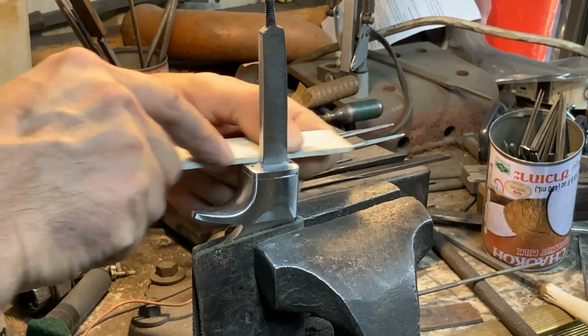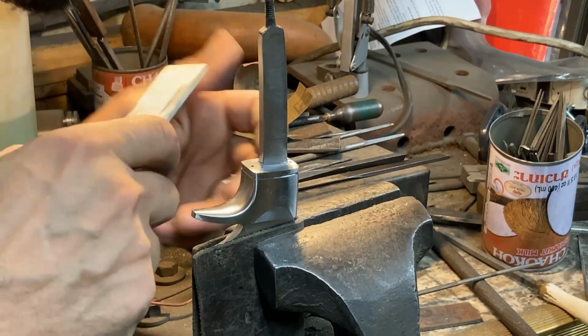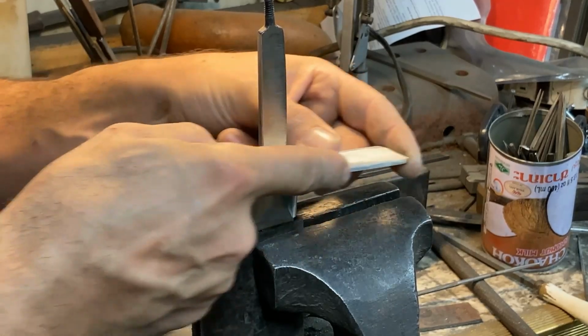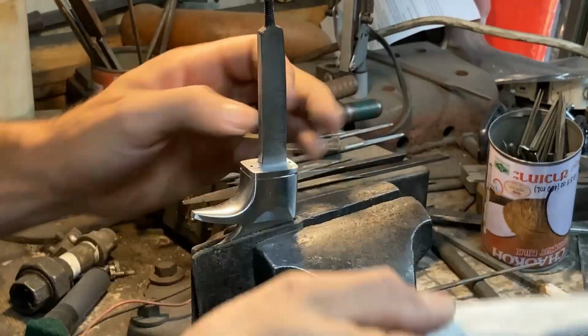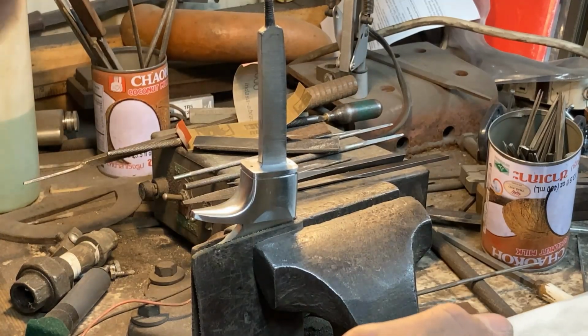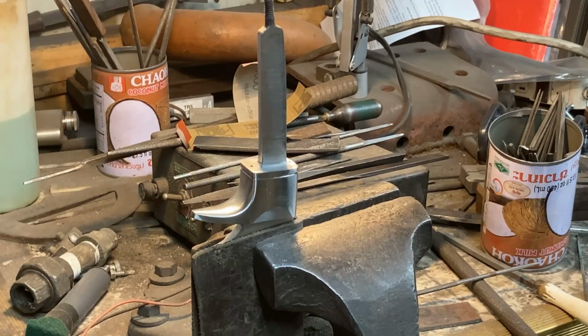Well, I did want to remove a little bit of material here that was causing some interference on the front of one of the scales, or both of them really, and just clean up any remaining schmutz from the heat treat. So this is, I think, a 220 grit aluminum oxide Falcon tool and die maker's stone. Works pretty good for this.